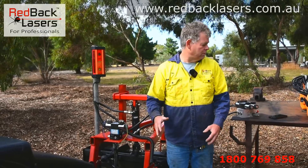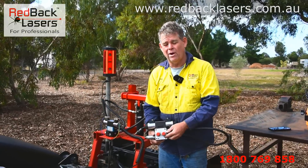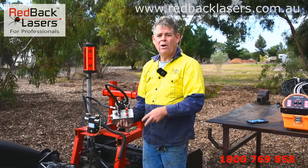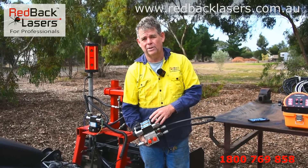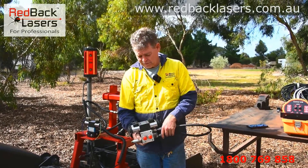If we're looking at the dual receiver system, you'll see I've got a bigger block. Again, we'd run two hydraulic hoses back to your live feed, and on the end I've just got that blocking off that bank — two separate hydraulic ram controls operated through those two solenoids. We would put flow restrictors underneath, sandwiched between the block and the solenoid restrictors.